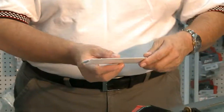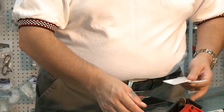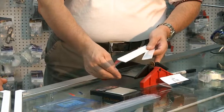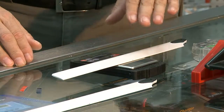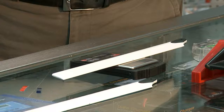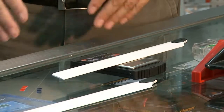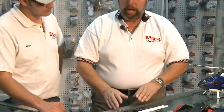Now that we've got our two blades balanced in the center, we have to weigh them and check that they are the same weight. Since we have the two balance points of the blades exactly the same, when we want to add weight to the blade to match them, we add it right at the center of gravity of the blade. So now we've got our two matched blades.